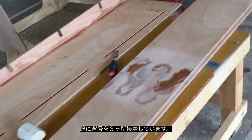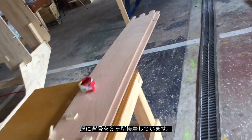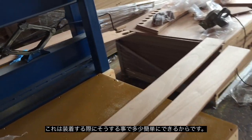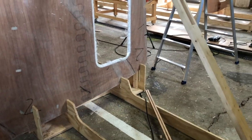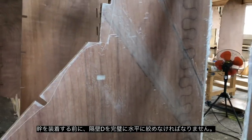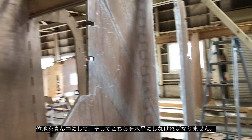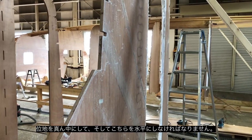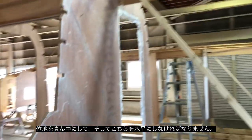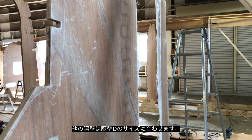I've already glued the backbone pieces together in shorter pieces so they're a little easier to manage. Before we put the backbone in, we put a brace onto bulkhead D just to make sure it was square — level within the frame and on the waterline. We put this brace on to make sure it was perfectly square, and then everything else will get measured from that point.